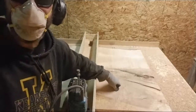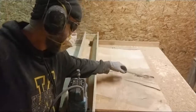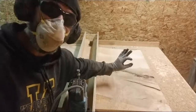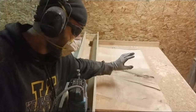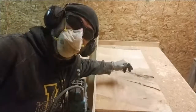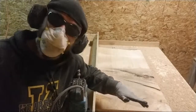Oh, your slab. Yeah, I got a lot more. But when you're milling a slab, the way I look at it, I always like to have an extra half inch thickness on the slab for flattening it. I talk to a lot of people who mill and they'll be like, oh, I like to mill 2 inches thick because that seems to be what people want.